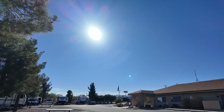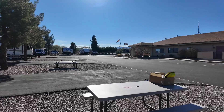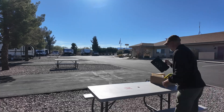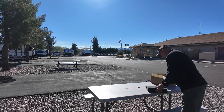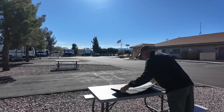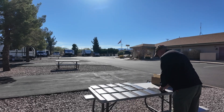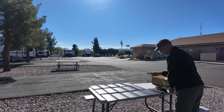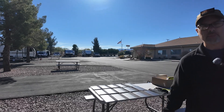With any solar video I have to show you the sky and the sunlight we're working with — and there's the picnic table. My solar panel today is a foldable 100 watt panel made by All Powers. I like it because it folds up small enough to fit into a backpack, so it can go anywhere. It is roughly picnic-table sized. We're not really facing 100% of the sun, so we're not going to get a full 100 watts out of that panel.